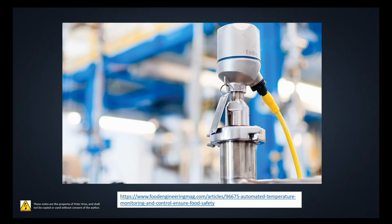Okay, this one here is from Endress+Hauser, right? This one has the ability to have the quick connect for the wiring here, so that if the transmitter goes out of whack for some reason, or the wiring gets smoked by somebody going by with a tow motor, you can replace either one and be quick to bring yourself back online.